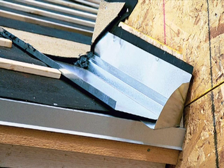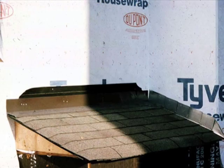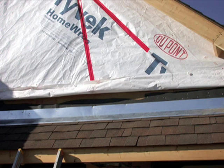Again, we have to be thinking about durability and longevity. Another common flashing condition occurs at shed roof-to-wall connections. As with step flashing, the building paper or house wrap must lap over the metal shed flashing in shingle fashion. We also recommend applying an adhesive membrane strip adhered to the top edge of the metal flashing and the wall sheathing material.